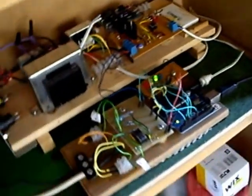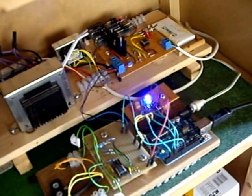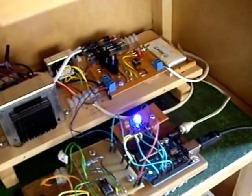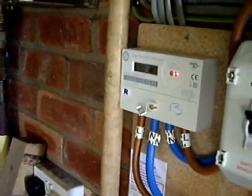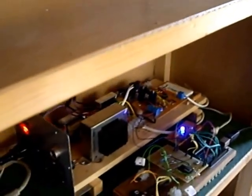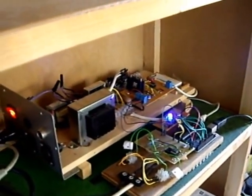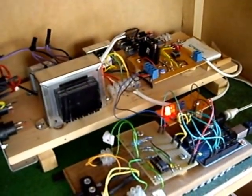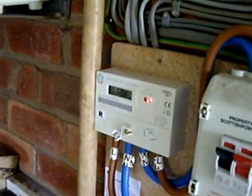As soon as I turn it off the control system is no longer closed — there's no feedback. So the control system tries to turn the immersion heater on ever harder to consume the excess power, but is unable to do so. As you can see the control system is now on full — blue light's on — and if I had the laptop you could see it was on setting 255. Needless to say we are exporting big time. So if I were to now turn the immersion back on — similar to the thermostat clicking on when you run off some water — we're now pretty well back into the second quartile of heating, and we're still exporting.